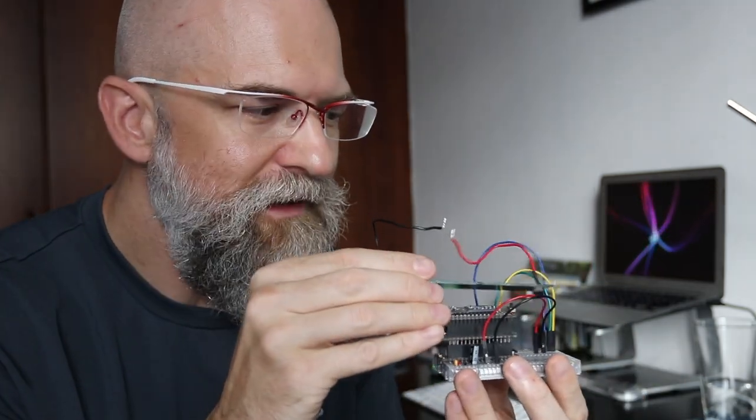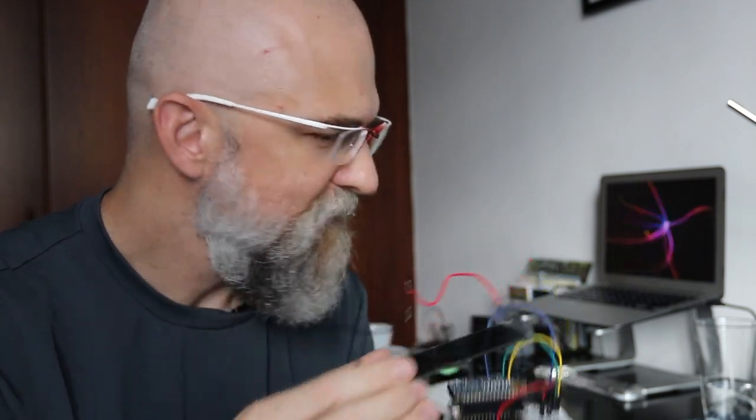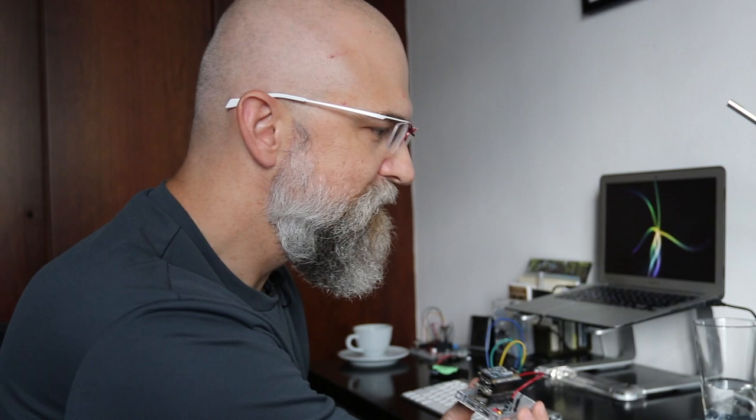The way I plan on doing it is having the glass sit right over top of the sensor like this, so that when I darken the glass it will have maximum effect on the sensor. If I have it raised up a bit, some light will get in from the sides. Also, I'm going to be using a waterproof electrical gang box, and that has limited space, so I have to get everything mashed in — the glass will be sitting down on top of the sensor.